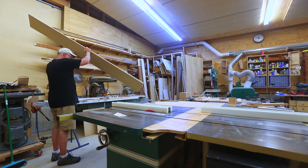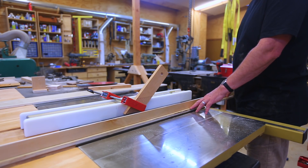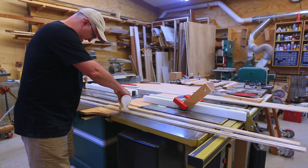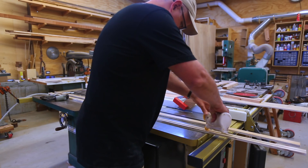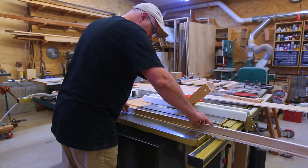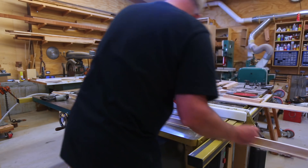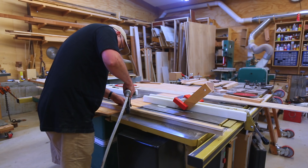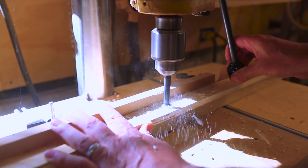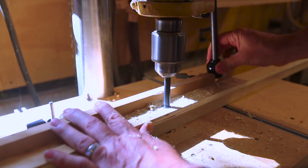Now I needed to make the boom for the camera. I cut two strips and made a T-section with those two strips so that it would be rigid both vertically and horizontally — if I just used a single strip of plywood it would have too much flex and the camera might bounce. So I glued and nailed it together. The axle on the gear that this mounts to I left a little bit long, and I ended up drilling a hole in the boom for that to fit into. This helps me center the boom when I attach it to the gear so it's in the right spot.